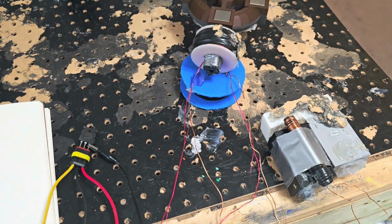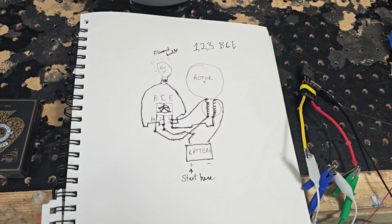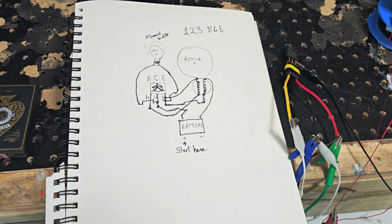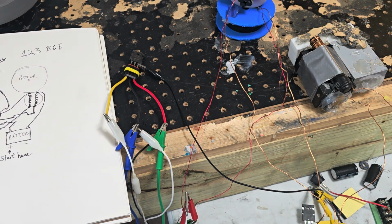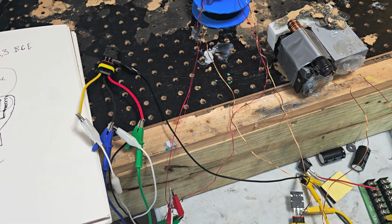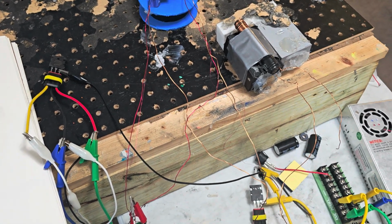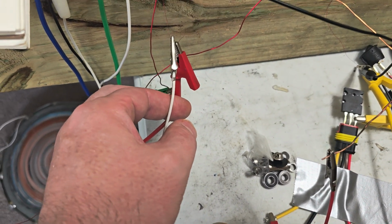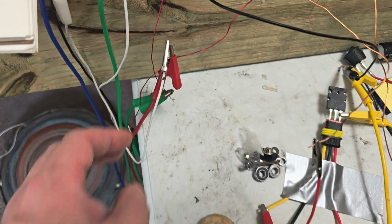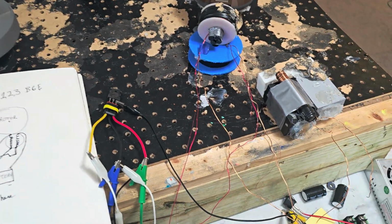And if you have a trifilar coil, you can opt to do it twice, that's what I've done. I simply repeated the circuit for the second strand in the trifilar. You just clip two clips to the trigger coil instead of one. Each trigger strand has two clips on it, one going to one circuit and one going to the other. But it's the same trigger. We're just using one trigger to fire both of them.